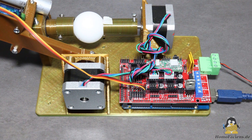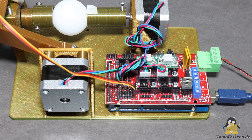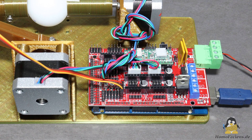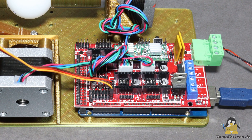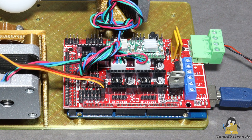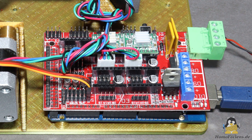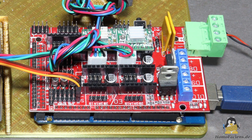The few components are assembled quite quickly and the wiring doesn't cause any problems either. Only two plugs need to be soldered to the two stepper motors. A big advantage of the RAMPS board is that it is available as a shield for the Arduino, which minimizes the amount of wiring. You must swap the two cables for the power supply on the servo plug before connecting that third component to the circuit board. 12V are delivered to the RAMPS board from an old computer power supply.